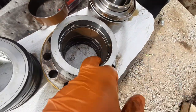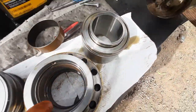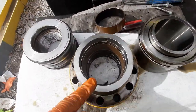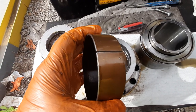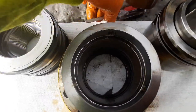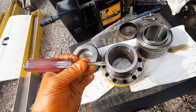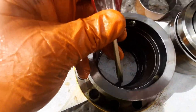You can tell the old one is worn out — the nylon is gone. You can see where debris got in and scratched it, probably because the seals went bad and were allowing dirt and fine particles in. There is a split on this bushing. As you get in here you'll see the seam, and that's where you drive it down using a flat-head screwdriver. Very minimal scratching to the housing — if any, just use emery cloth to polish it up.